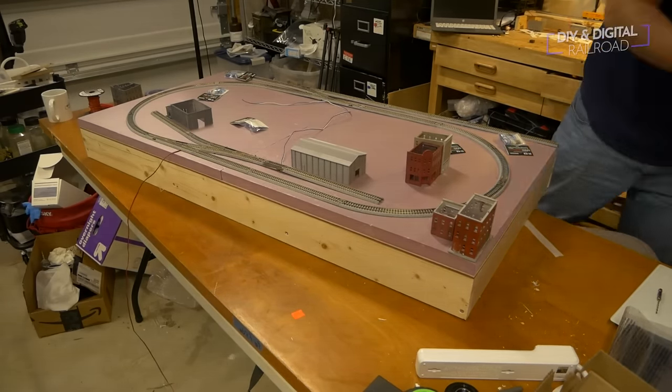We are going to wire up the 5-volt bus switch a little differently than we did the 12-volt bus. We want the switch to control the entire bus, so we will be inserting the switch into the main power line to the 5-volt bus. To do this, we will be using one of these DC terminal adapter jacks. We start by hooking both of our red feeders from the switch into the positive side of the terminal jack.